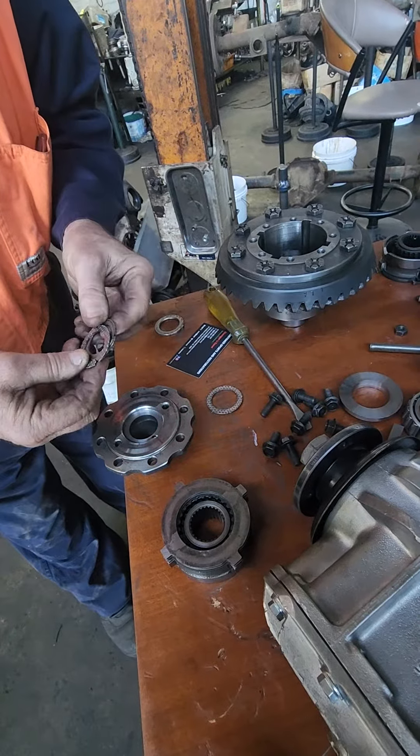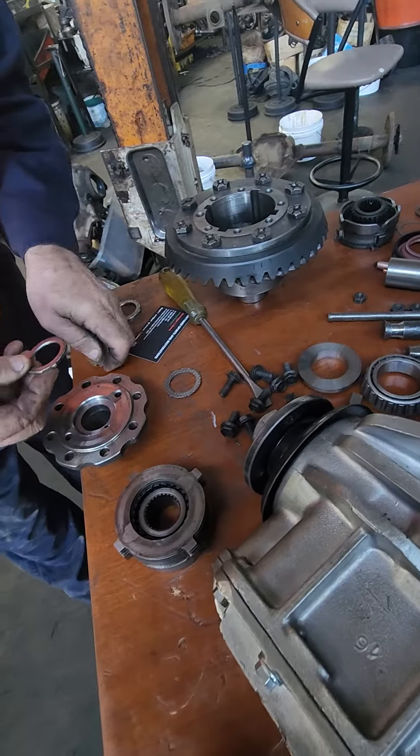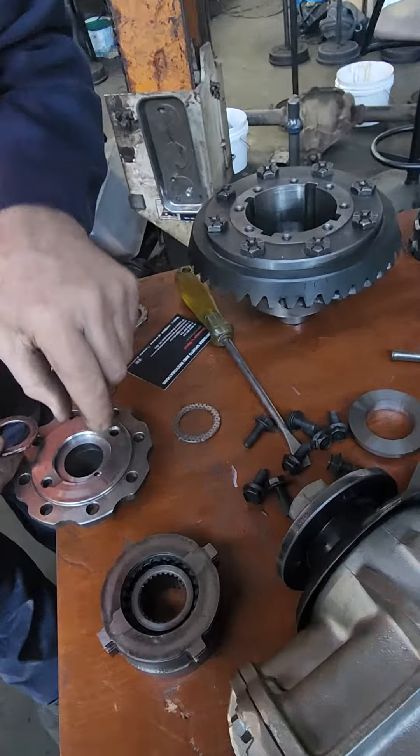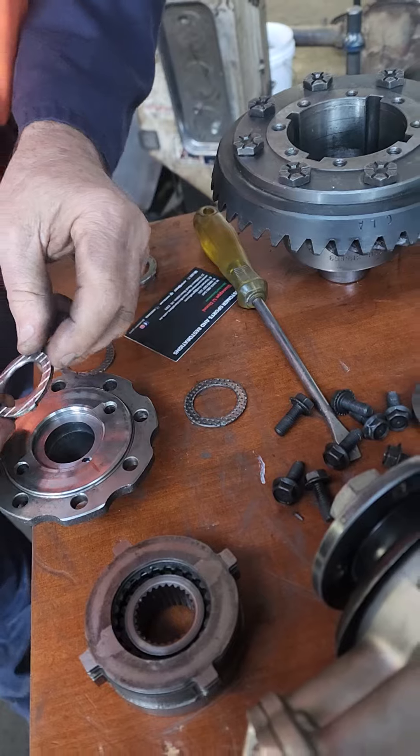So we made these — one mill, these are nearly two mill, these are three mill. We had to drill that half round, make a jig, and put a flat bottom drill down in there to do the same with that.